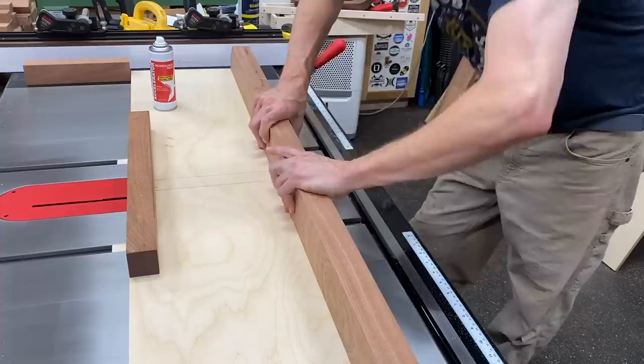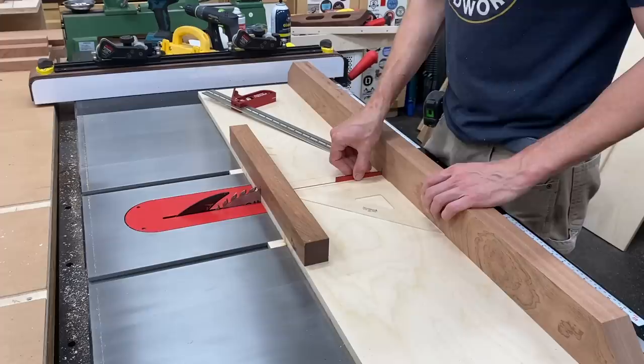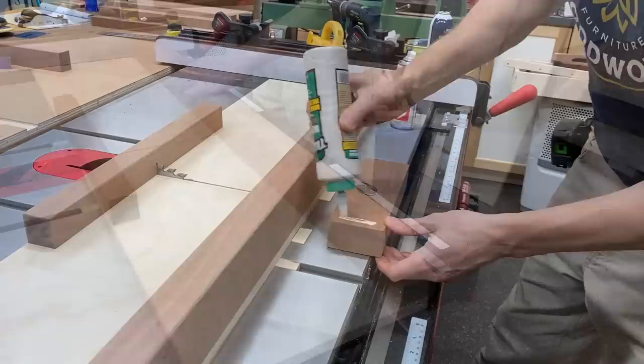I flipped it over and brought the fence in — this is a piece of Sapele that I milled flat and square just for this purpose. I used a little CA glue in the middle just to tack it in place. My thought process was to secure the fence around the blade, make a cut through, check for square, and then adjust the outer ends of the fence. Since my blade is perfectly one-eighth of an inch, I used an eighth-inch setup block and then a square to check that the cut is square to the fence — and I got lucky, it was dead on.